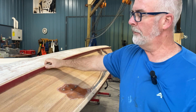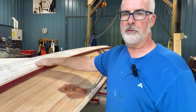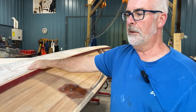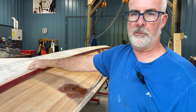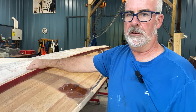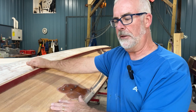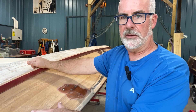I need to remove the splash rail — I can see cracks between it and the hull and dark spots, which means water has gotten through. I'll take that off, finish-sand the top part, then re-bed it. It fastens from the inside of the boat, so I'll re-bed it with 5200 by 3M — that'll give good adhesion and seal out water in the future. I'll also soak it in Smith's Epoxy Sealer for even more protection, as I will with the bottom, which will get a barrier coat. The bright sides I typically don't put Smith's on.